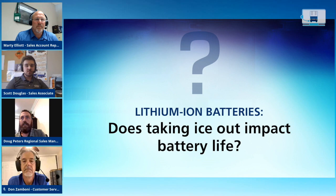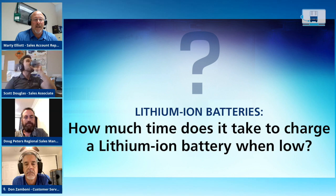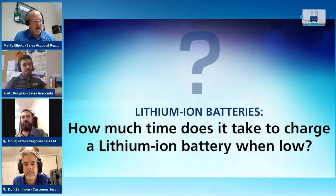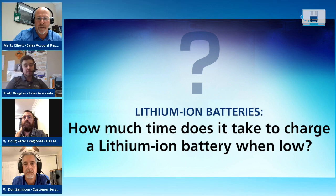Marty, I'd like to have you answer a question: how much time does it take to charge a lithium-ion battery when it's low? Yeah, that question actually gets asked a lot, and I know Scott can speak to this when we are out training operators on the new 450. The best way to describe it is, whatever your discharge time is, your flood time, just multiply it by 1.5. 10-minute flood, 15-minute charge.